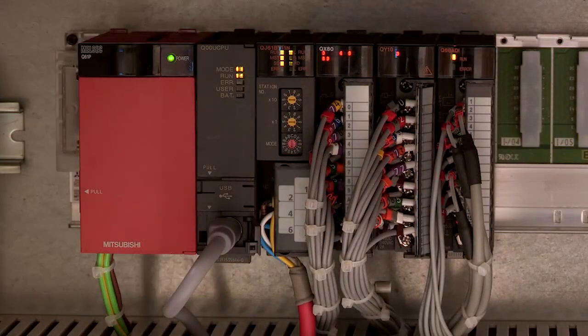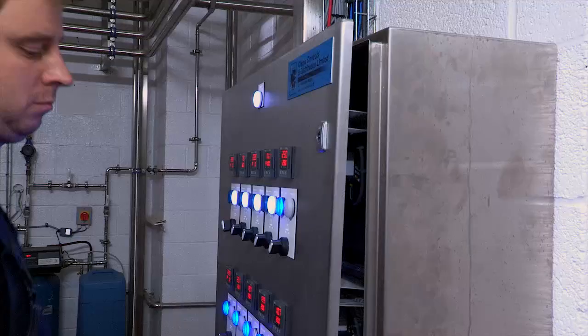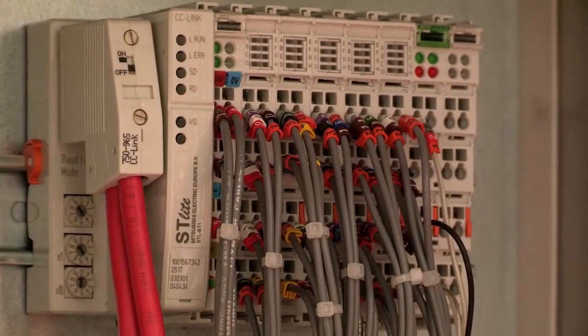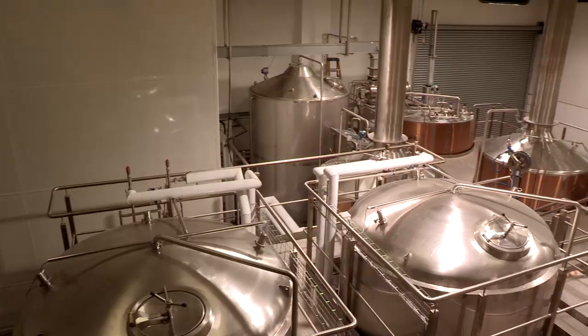We initially decided to make the main PLC within the desk and then deploy CC-Link networking throughout the various areas of the plant, and also control IO and the inverters that were used to give finite control.